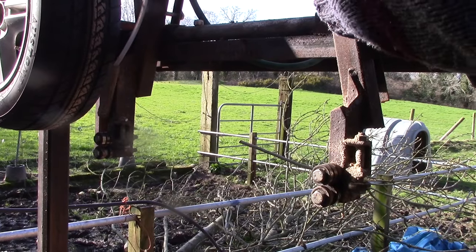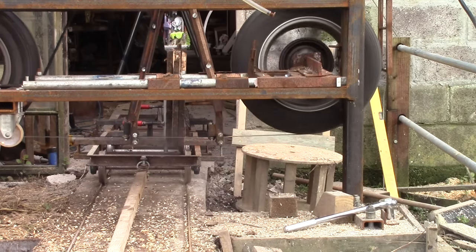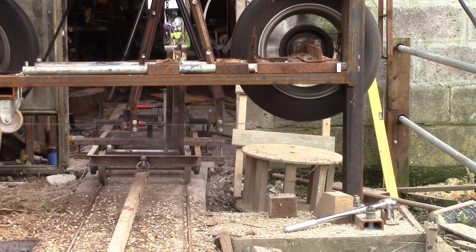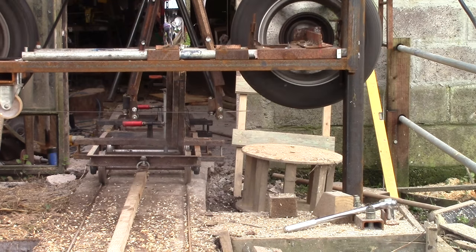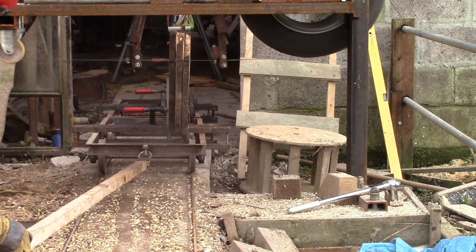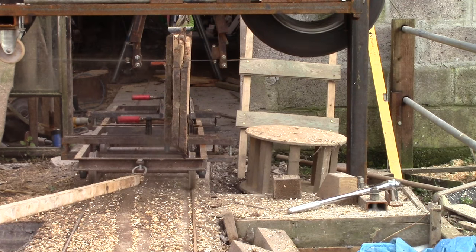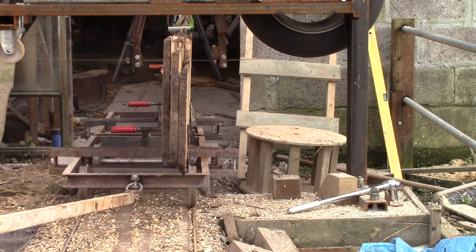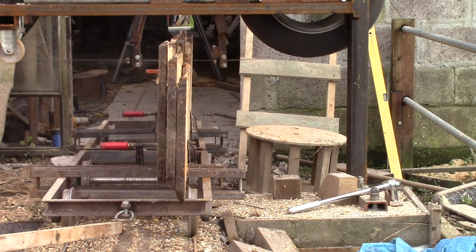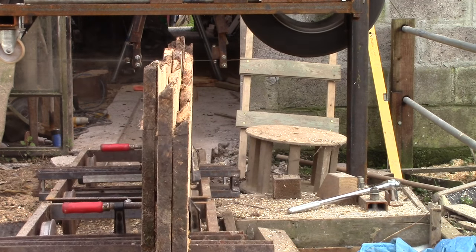But with a door like this, you can just cover the cracks between the boards with a batten, just the way people have been doing it for thousands of years. So all I'm doing is edging the planks and butting them up — crude, but functional. They're way too heavy to manage properly through the bench saw, so I'm using the bandsaw.